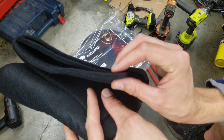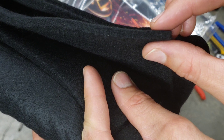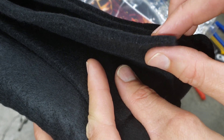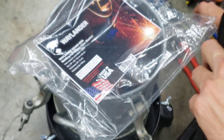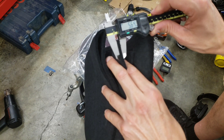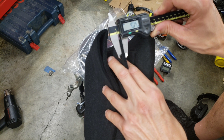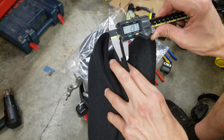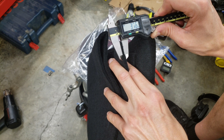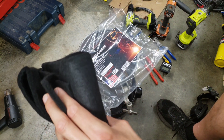It's a pretty thick felt. It says about three millimeters thick — I think that's pretty generous. We can take a look at it with the calipers. The thickness rating is very generous, which is unusual for stuff like this. I'm measuring it fluffed up at almost six millimeters. But if you compress it, it compresses down to about three millimeters. So that thickness rating is almost like a compressed thickness. Pretty generous.